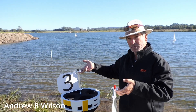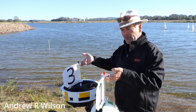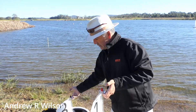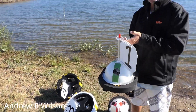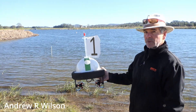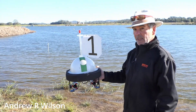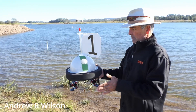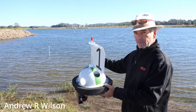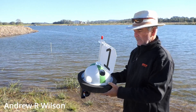We know we're onto something that helps the radio sailing community. We can demonstrate this at a later point — you can launch them and operate them individually in manual mode, where you point them in the direction you want and tell them to go a particular distance. Or you can do that semi-automatically: you tell the buoy to take a compass bearing for a particular distance, hit the trundle button as we call it, and off it goes. When it gets to that point, anchors up and stays there, within the limits of the GPS technology.